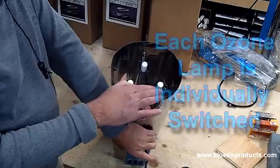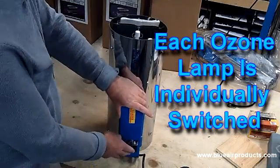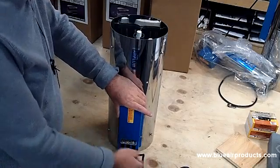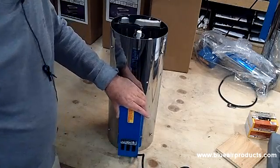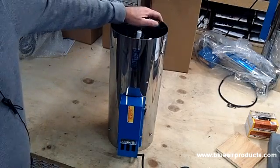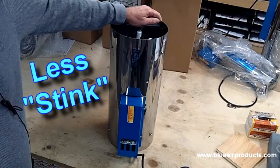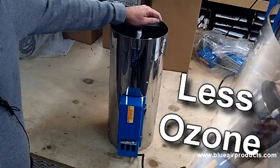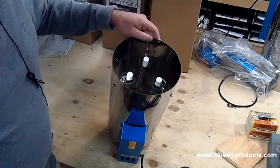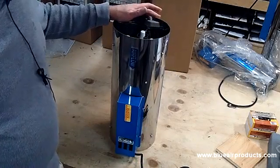Each of the Big Blue ozone lamps is individually switched so that I can turn on one, two, three, or any combination thereof. The idea is that early in the growth cycle, for example, when the plants are immature, I don't need all the lamps running. In other words, I'm going to end up maybe over-ozonating my exhausted air. So I can control the amount of ozone that I'm putting in when I use the multiple lamp units — the 6, the 8, the 10, the 12.